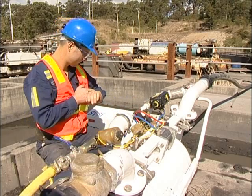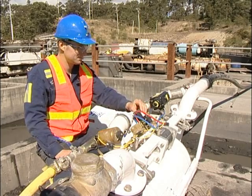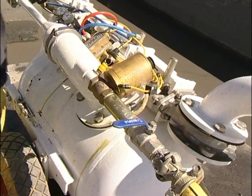If either the discharge or suction are blocked, the stored pressure in the vessel can be relieved by doing the following: removing the cover, turning off the supply air, and discharging the pressure by lifting the safety valve.